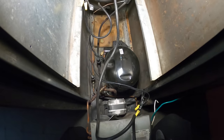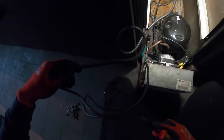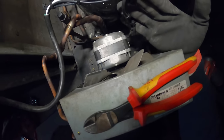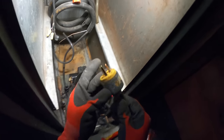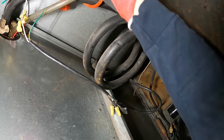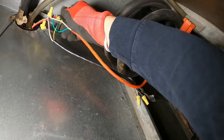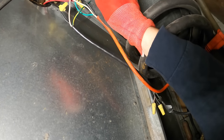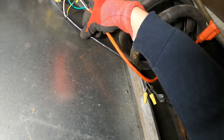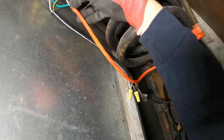We do need a plug and this is pretty heavy duty. I could probably use that, but let's at least shorten this up and make it neat. Let's just get rid of all this and do it one step at a time. We're gonna reuse this plug, tighten this up — everything was just loose. That's definitely better, a bit neater. Get rid of all this and do it how they intended it, with a receptacle. I can see the red wire here — there's a black, red, and white. Black and white is just power for the fans inside, and then the red wire comes out as the trigger wire — that's what turns on the condensing unit. Comes back white with neutral.